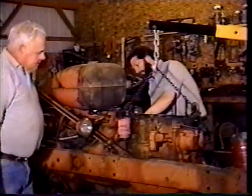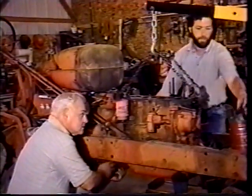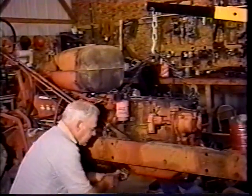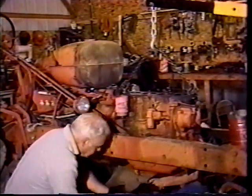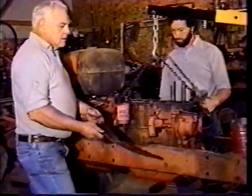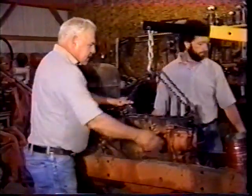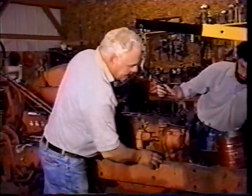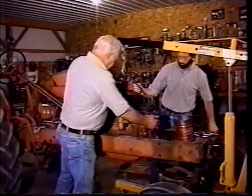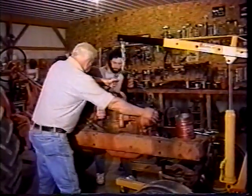And underneath there's a little inspection cover. It has two little bolts, and it's really behind the flywheel, or to the front of the flywheel, and it has to come out in order for the motor to come ahead. This little plate right here. Other than all the unforeseen things that we haven't checked yet, I think we're ready to pull this motor ahead, Dan, if we can. Okay. Probably have to go up a bit. Okay, I see it move. We got a pry bar in here, pry bar behind there, so you can slide it ahead.